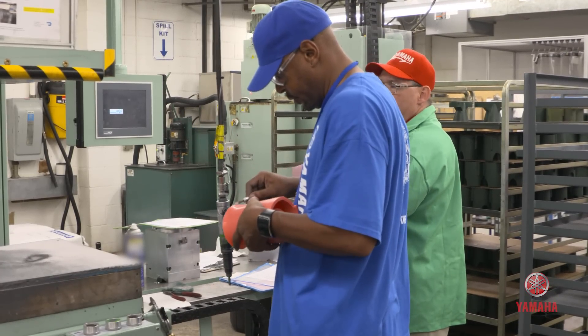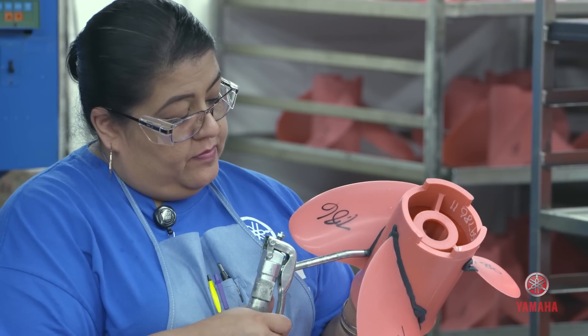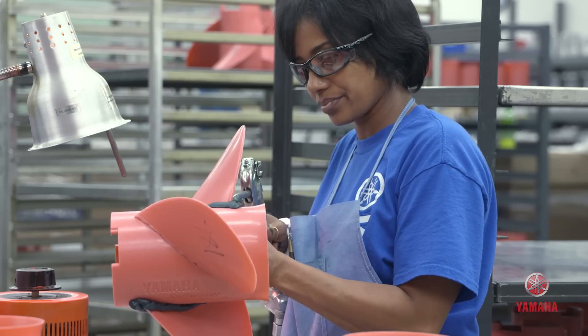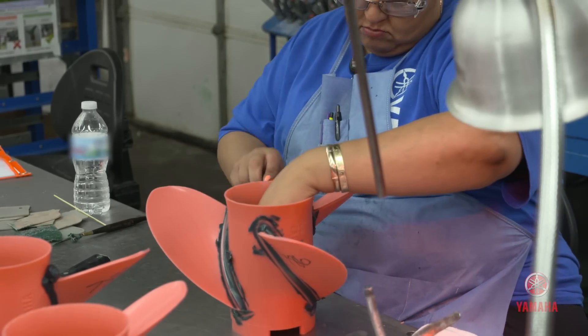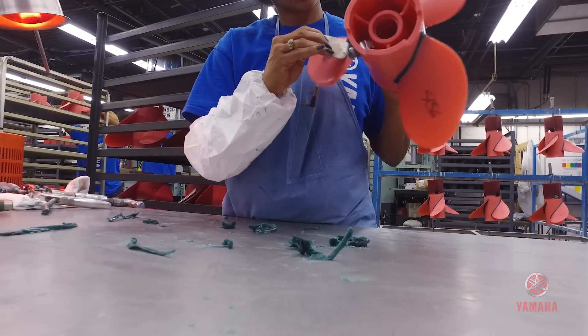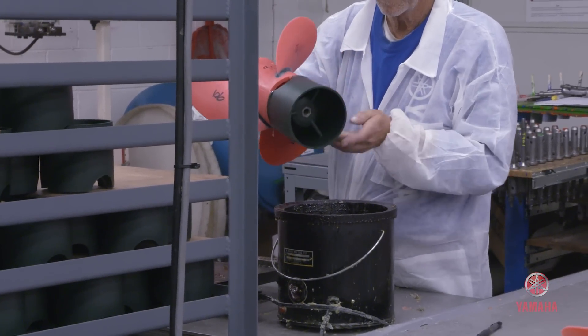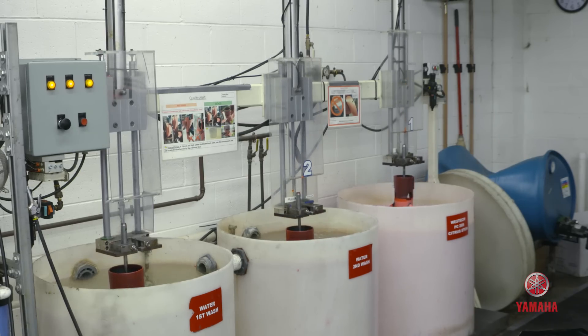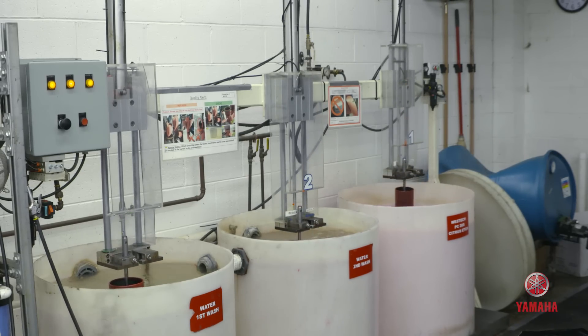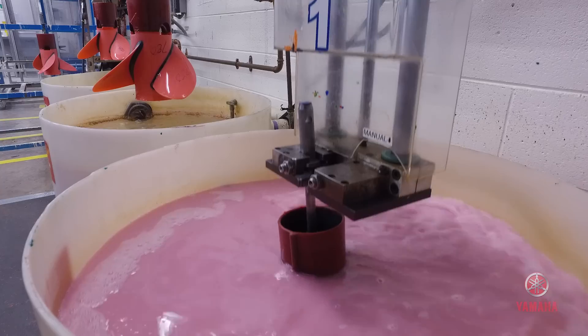The wax injects into the die like toothpaste. The blades are then welded on — nothing more than a solder and iron. We then use an automotive goop gun with a heat exchanger on it and roll that material out to give it the root radius. The parts are then cleaned up, scraped, and thinned down. Pour cups are put on the propellers, which just act as a funnel. We have a washing station with a soluble citric material that etches and cleans off any lubricant from the die.